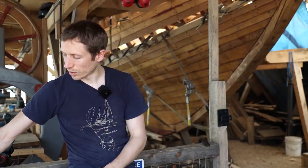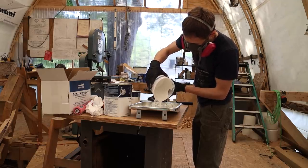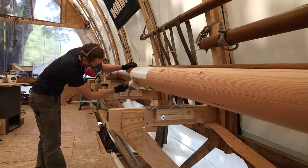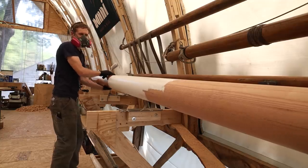The paint is mixed and it's going to sit for a bit. There are some heavy solvents and chemicals, so we're wearing respirators to protect our lungs. The reason for the break is that once the two parts are mixed, they need to go through an induction period — the paint needs to sit for 15 minutes while the chemical reaction gets started, and you want to do that before adding the reducer, i.e., the paint thinner. This kind of paint is a little thick so you'll automatically get some texture. These coats are just to seal; they'll level a little but not much. Once all the coats are on, that gets sanded down to a smooth finish, and then you can put on your enamel paints.